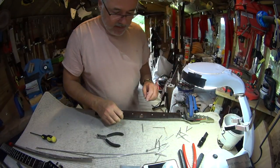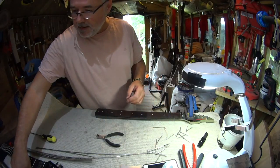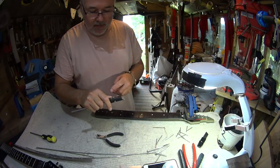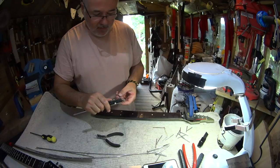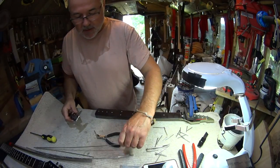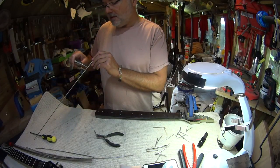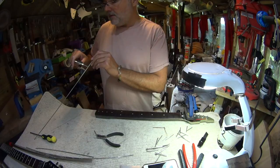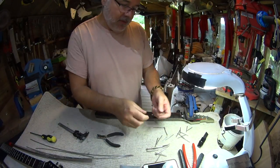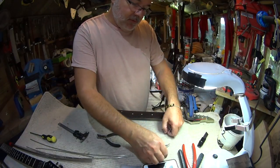Okay, let's leave that running because I'm going to switch. Let's see. It's maybe not such a good thing because it depends where you grip the tang, but let's see as a general bite. 27 something or other, hundredths of a millimeter. 32, so slightly wider, so these will have a little bit of a grip on their own anyway. You never know, might get away without any glue at all.